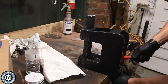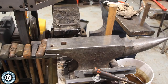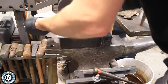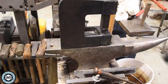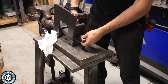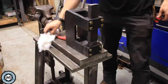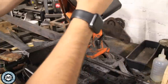I also threw a little bit of wax on the top tools for all the guillotine tooling so that they'd slide a little bit better through the guide. You can see I added my little post to the furthest back hole, and you can see how nicely it sits on my lightweight Peter Wright anvil — about 150 pounds. In the background I've got a 400-pound Fisher that I've also positioned a hole for, so I can push the hardy shank in there. I'm also able to move it up to the front and use it in my striking anvil that I just built.